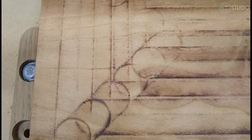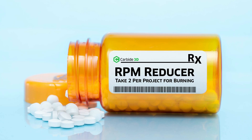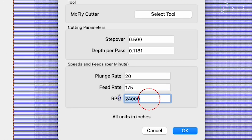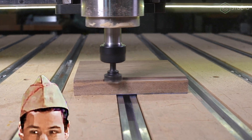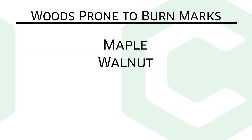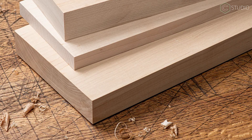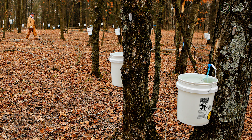This is the most frustrating issue surrounding use of these cutters and the one which receives the most bad advice. If you're experiencing burning, the vast majority of the time an RPM reduction will eliminate this issue. Your RPMs are simply too high. Think of trying to start a fire like a caveman or a boy scout. Turning a stick into wood creates friction, and that's what you're doing here — creating heat through friction. For every wood, there is a window of RPM range that will cut effectively without creating burning. Maple has a smaller window because of its hardness and sugar content. That's right, the sugar content.